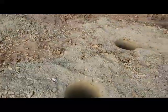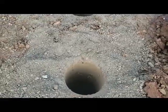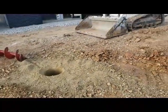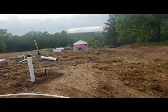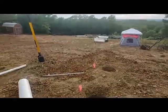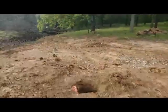We did get a few of the holes done for the pillars — going almost four feet deep. James is making the rebar post to go inside of there. We've got all of our ends done. There's another one over there, and we got these four done as well. So we've got one over there, two here, and one there — each of the corners will have a concrete post that will hold them.